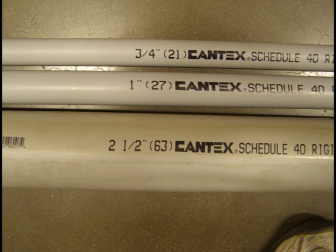This next picture shows three different sizes of electrical conduit — plastic conduit designed for direct burial. The three-quarter inch on top is what I recommend against ever using. You want to use a combination of two of the one-inch pieces in the center for your data and your phone. And then for your main riser for your power, you want to use the two-and-a-half-inch size. So for your underground riser coming into your panel, you want to use a two-and-a-half-inch, approximately two and a half to three feet long, and two number-one-inch. Tape them together and secure them quite well between the footings.